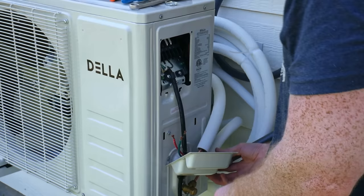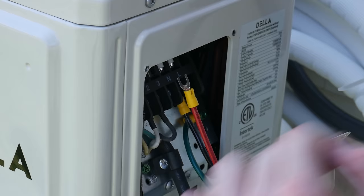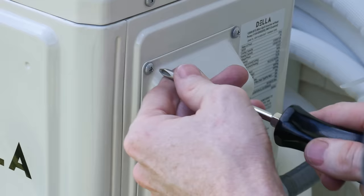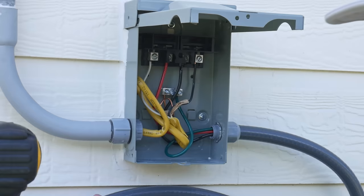Over at the unit I fed the wires in from the whip, cut them to a shorter length, stripped them, and added connectors to the ends. This side of the panel is simple: attach your green wire to the green ground screw on the right side, your red or white wire to the neutral, and the black wire to the load. After that, put the panel cover on and you're done with the electrical. I made sure to leave the quick connect crossbar in the off orientation while continuing the install for an added level of safety.